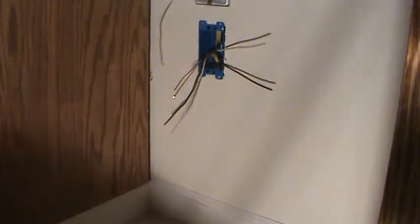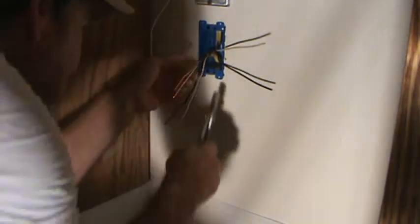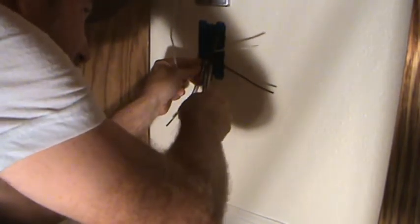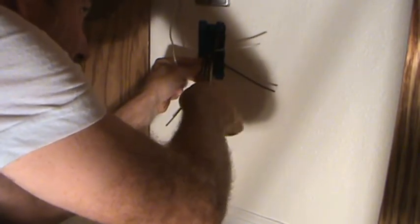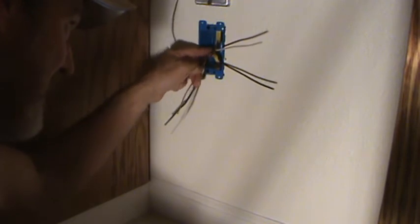Okay, so you're going to take the little sleeve and slide it up in there. And they have a crimper tool, and usually it's a little nib on electrical strippers like these. But this one apparently doesn't have it. Usually it's right in here, and you put it over your sleeve and crimp down on it. But I'll get my trusty pliers out and smash it on and grab the edge and pinch it some more. Okay, that works like that. That's never going to come apart, and even if it ever did break, you've got this wrapped around. We're trying to keep everything grounded properly.